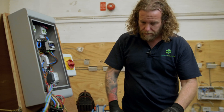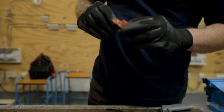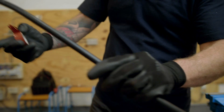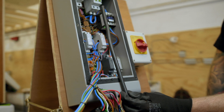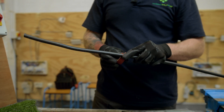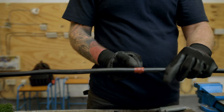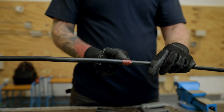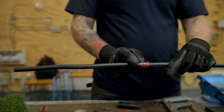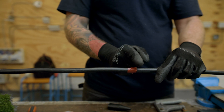I find it easiest to mark my armoured out with a bit of tape, just so I know where to strip it. First of all, let's work out how much we need in there — we need about that much, just to be safe. So let's put a bit of tape round here. That gives me two lines. This first one is where I'm going to strip the outside off — the armouring. And then this second one is where I'm going to strip the rubber off, just to expose the conductors.